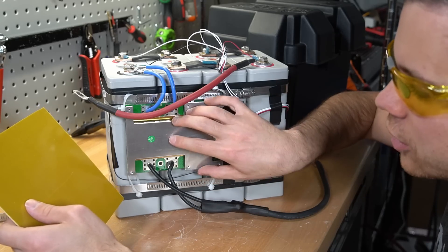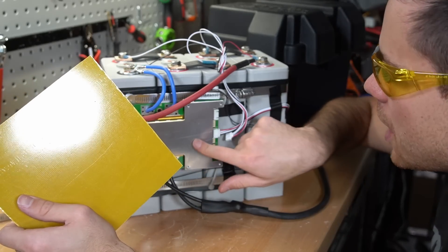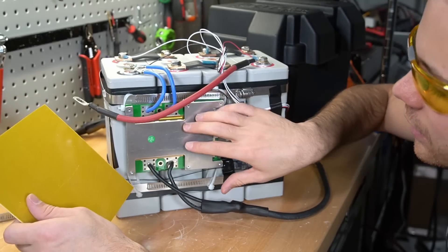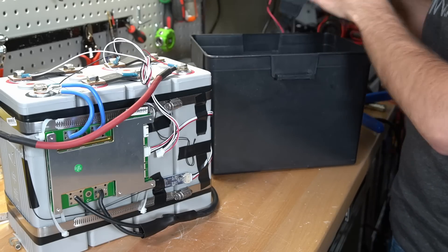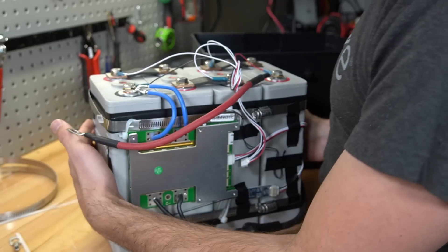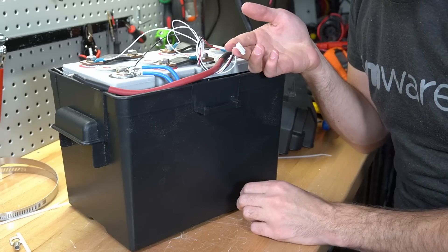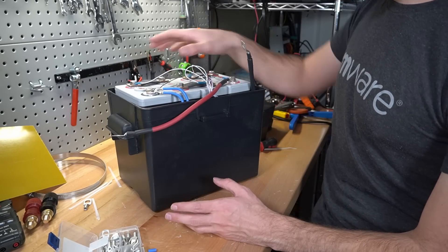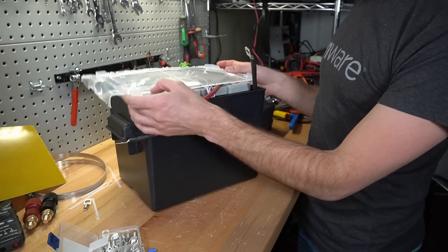If you plan to use this with multiple wires and push a lot of amps, you should add a fiberboard or some kind of insulated hard material between the BMS and the cells so the cells do not heat up. For our application and C-rate it will be fine as-is, especially with these large cells which can absorb a lot of heat. Shoving the battery into the box is probably the hardest part - be very careful of the live unfused wire. Make sure you can still access the balance cable. The biggest design flaw is all the unprotected terminals, so we need to add some kind of insulated protection on top.